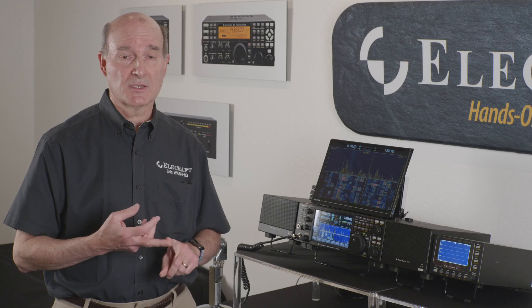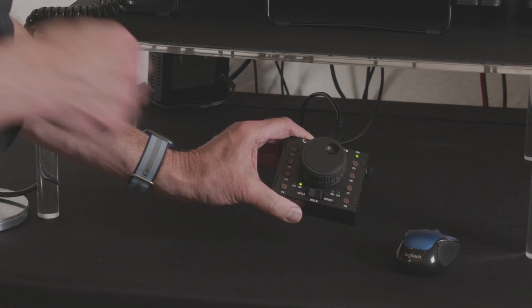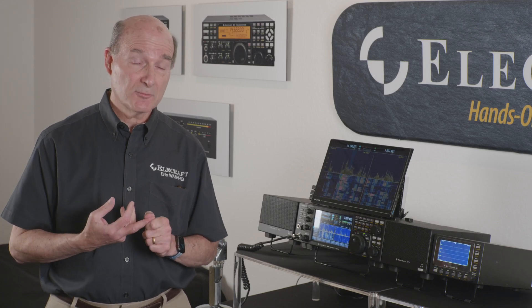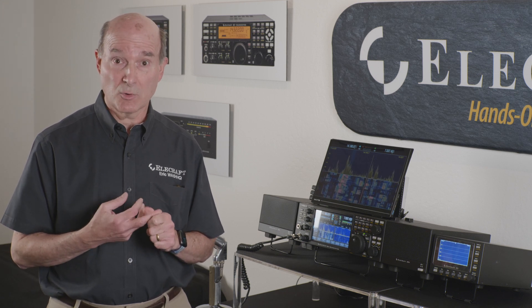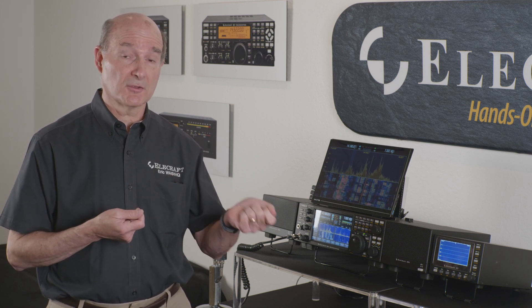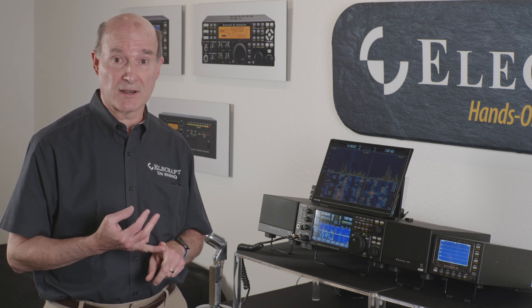The K4 also offers a wide range of I/O, both digital and analog, for talking to the radio. There are multiple USB-A ports where you can plug in keyboards, mice, and other devices like our K-Pod external VFO knob — which has programmable function keys and an external VFO that can be connected to VFO A, VFO B, or RIT. There's also a USB-B jack with digital COM port control over USB for logging programs and remote control, plus a built-in sound card for a single cable connection to support digital modes like FT8 and PSK31. We also have HDMI output and line-in/line-out physical audio connections.